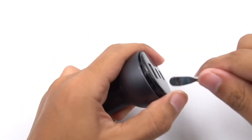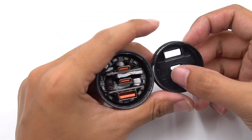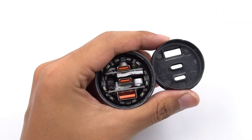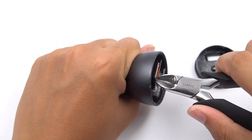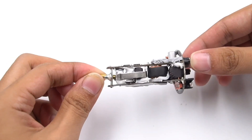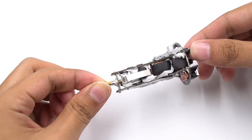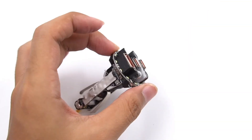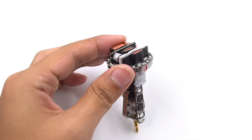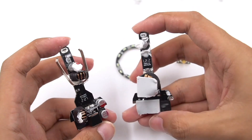Let's tear it down. Removing the top case first, we can see the LED light. Every single USB port has its own PCB and is filled with thermal pads. Taking out the car charger module, we can see that two PCBs are connected by the input PCB and fixed by the input pogo pins. A long strip thermal pad is attached to the PCB, and insulation tape is attached to all three USB ports. Splitting the module, we can also see the thermal pad.